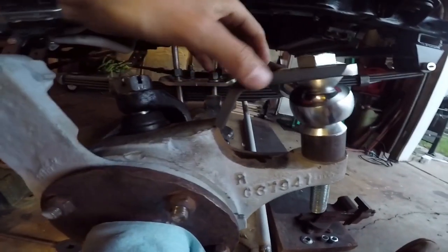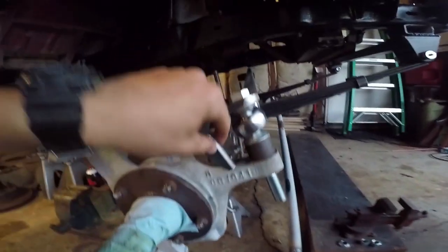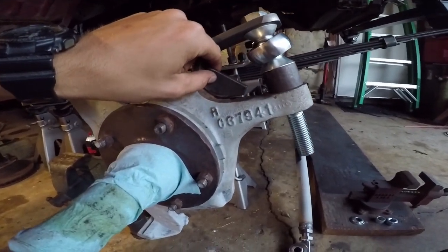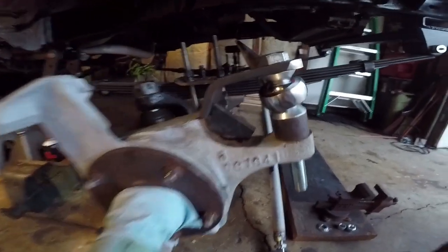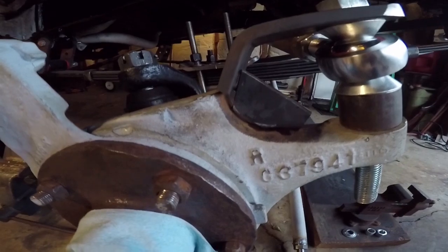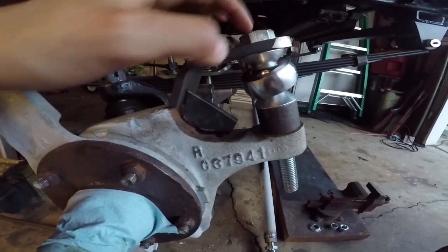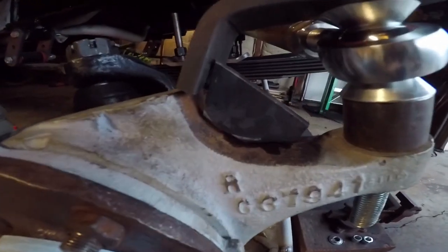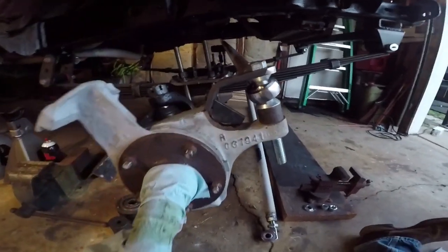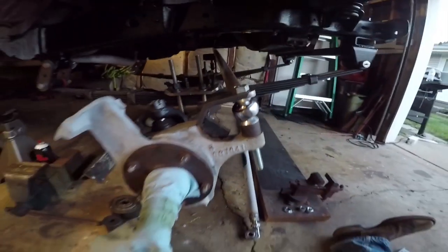All right. I've cut it off. I cut it a little bit short — there's just a little bit of a gap in there — but it'll be okay. I can fill that gap; it's not a major gap. Then I had to modify this piece — it was more of a triangle. I just cut a little chunk off it. You can see there's a gap there but it's just a little sliver. That'll support it some more and give more area to weld, other than just a straight line across here, which would just likely bend with the bolt. This will kind of tie it all together and hold it strong. It's as simple as that — it was the wrong one and all I did was cut it a little bit. Made it work. I just got to weld it in there.